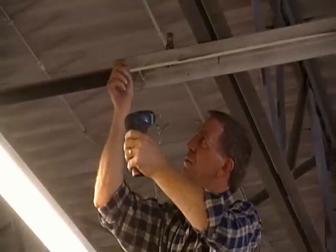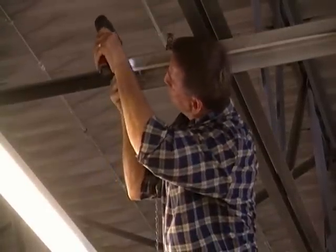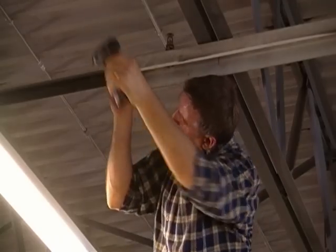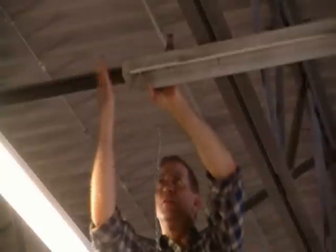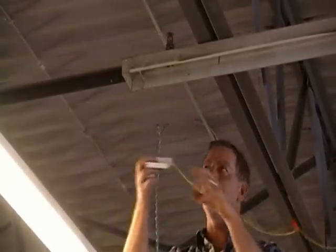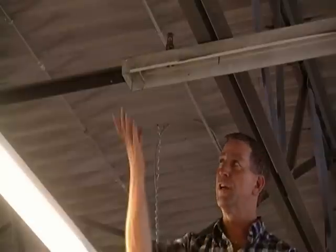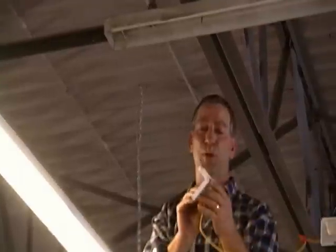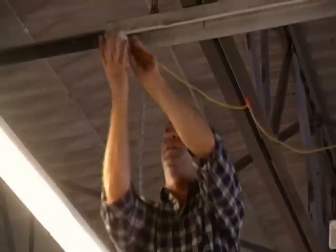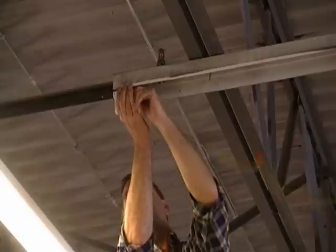Where you have a row-mounted situation you will not likely be required to perform this step. You have your end cap intact. Now you can take one of your pre-wired end plates with yellow wires and attach it to the fixture channel. This fixture channel happens to be four and a half inches. This plate works on any fixture between four and five inches. Simply telescope out the sliders on each side, attach it over your channel, and squish it back into place right on the end of the fixture.